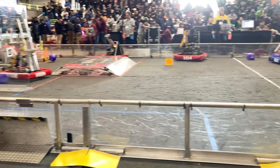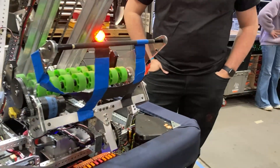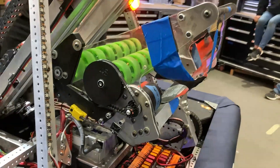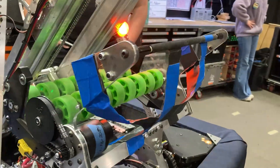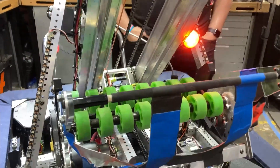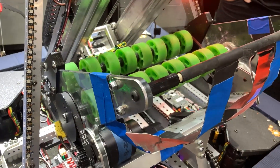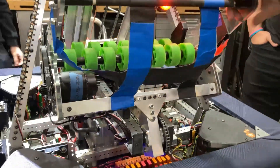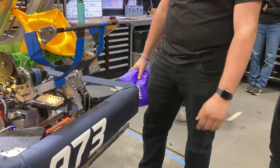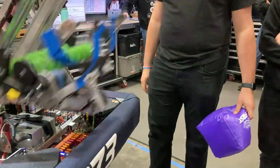The next thing we're going to talk about is the intake on the front of this robot and the wrist that powers it. For the intake, we went through a lot of different iterations. We started out with something similar to a 2018-style intake with the two side grabbers, but then we quickly realized — especially after we saw the every-bot claw and how good that was — that something like that might be the way to go. We implemented a couple of different designs of that. Initially there was a powered roller here, three rollers total, but we found that was kind of big and awkward. We didn't really need it, so we tried without it and it worked just fine.